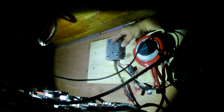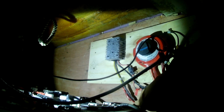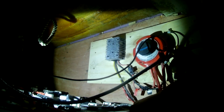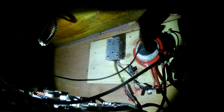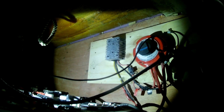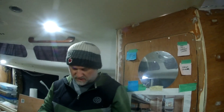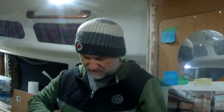This device here is my 48-volt to 12-volt converter. The inputs feed directly off the battery system — all wired in series — and come out with two cables at 48 volts. I then take a lead off and feed it into this Celia buck converter. It's basically a large heat sink with some transistors inside that convert 48 volts down to 12 volts. Why am I changing it? I'm not convinced the Celia is marine-compatible — my feeling is it will wear out over time.